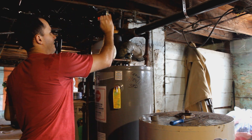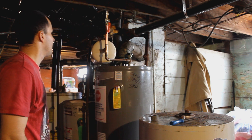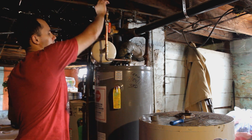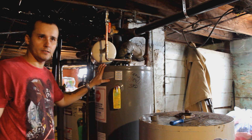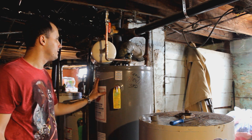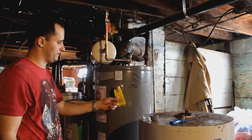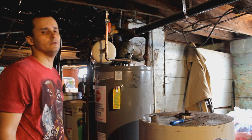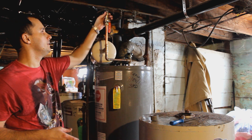Now turn back on the water and look to see if you see any leak. Remember, always when you're going to work on the water heater, turn off the pilot and turn off the gas or you're going to damage your tank. That should be all set and this should stop leaking. I hope you enjoy. I'll post a picture of all the tools and materials I used. I'm not a plumber — this is my first time, but it's very easy; you don't need to weld, just push and connect.